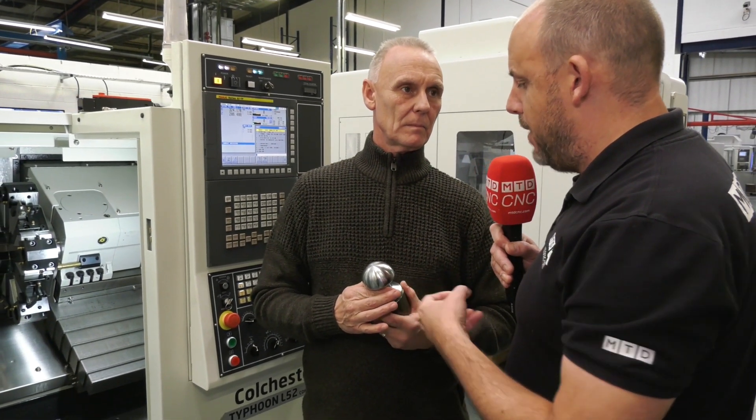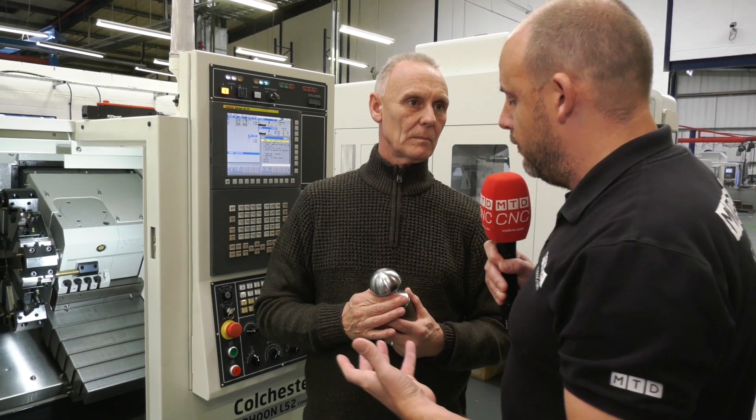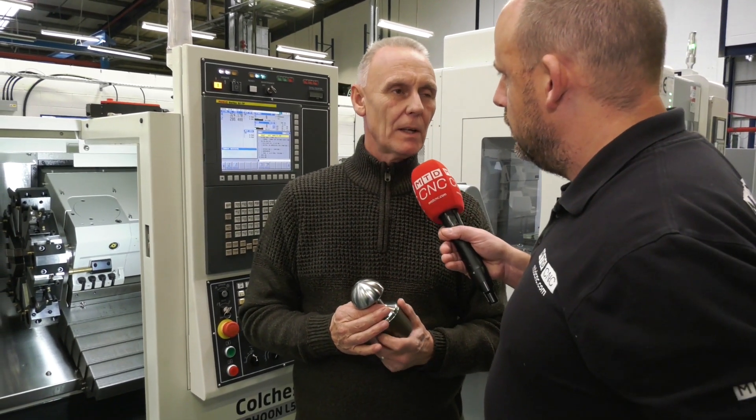So that's not hanging around. What about the actual heat in the part? Does that affect the outcome of the component in terms of its tolerances and accuracies? Not really, no. The way the inserts are designed, dissipating the heat through the chips, most of the heat is taken away from the actual component itself. It does get warm, but not to a certain extent that will really affect the tolerances of the component.